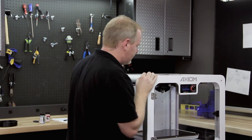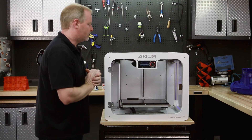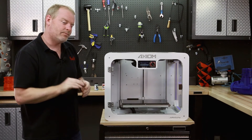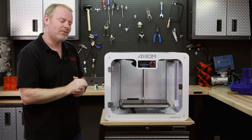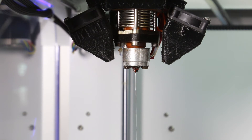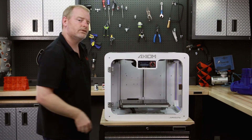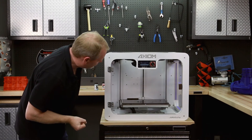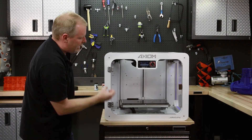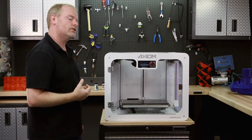What we're doing right now is actually one of the most difficult things you can do with a desktop 3D printer — pushing polycarbonate through a hot end using the softest material you can get your hands on. You can see the polycarbonate getting pushed out and the TPE coming right out of the hot end. We'll give it a few more primes to double, triple, quadruple-check that all the hard polycarbonate is out. You'll see some black and clear alternating, and I really recommend doing this several times to ensure all the material has cleared.